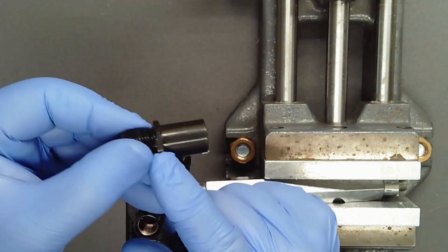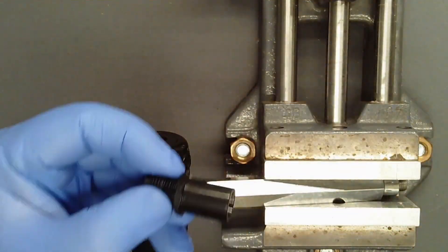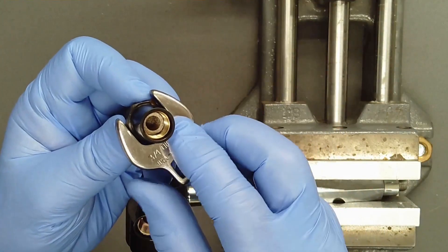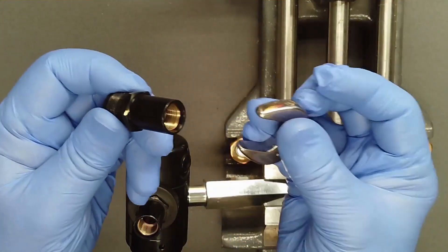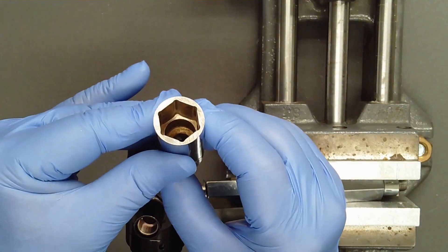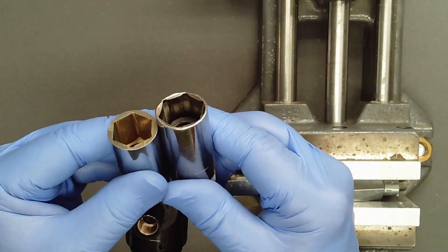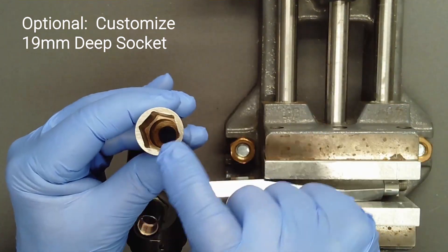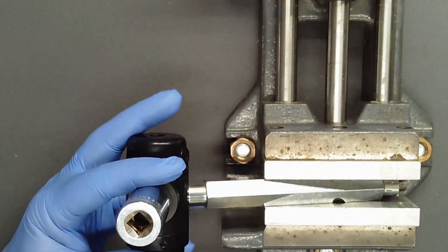The hex flats of the DIN housing are deliberately shallow in order to allow free rotation of the DIN wheel. If an open-end crow foot attachment is used to torque this fitting, all of the force is applied to only two sides of the hex, and there is a risk of fracturing a point if excessive torque is applied or the tool slips. Instead, a six-point socket will apply force on all six sides of the housing. However, most modern sockets are supplied with a chamfer, which will decrease the area over which force is applied. The safest approach, therefore, is to grind the chamfer from the socket so that the fitting fits flush against the housing.